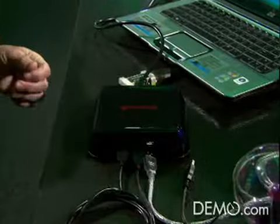A universal power supply today refers to the universal input voltage — AC voltage — so different voltages as you see all over the world. But a GreenTalk-enabled power supply is truly universal. It's universal both at the AC input voltage, but more importantly, it's universal at the DC output voltage. Our GreenTalk-enabled power supplies shut off power to the port whenever they sense that the device no longer needs power. By doing that, we basically eliminate standby, or what really is wasted power, on the client's side. It's reusable — you can use the power supply to power any electronic device that you'll be buying in the future when it's GreenTalk-enabled.